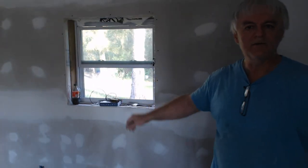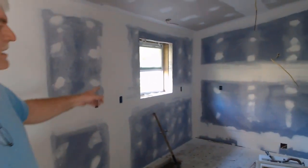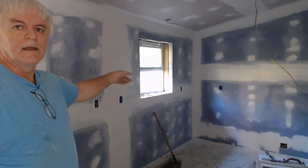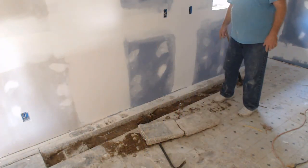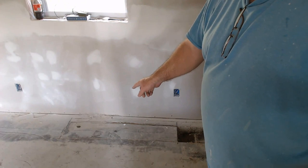One of the things we have to do is we're putting our kitchen — we moved the kitchen from this window here, the sink was under this window, and we moved our kitchen sink to under this window over here. We had this trench that we've cut out of the concrete from where the drain came up through the floor. This is where the drain was previously, but we need to get the drain moved to that window. So we've cut this trough, we've cut out the slab in this section, and we're going to connect onto that drain line and move it over here.